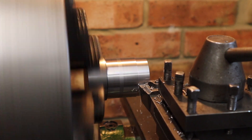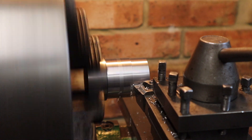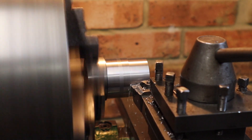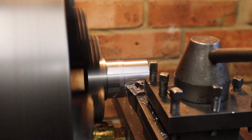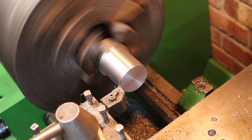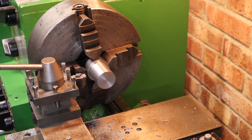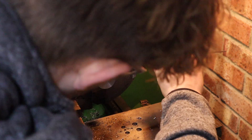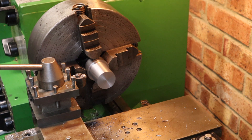We're currently just over 5mm depth of cut now, so about halfway there. I'm running the lathe on power feed with a 1.5mm depth of cut, and so far the finish looks really good and I'm getting good chip control - thumbs up, it's going well. According to the hand wheel on my cross slide, I've taken off 10mm worth of stock. Currently reading 40.87mm and the hole in our block is 40.5mm, so I haven't got much more to go - one final pass and we should have a nice snug fit in our tool post.